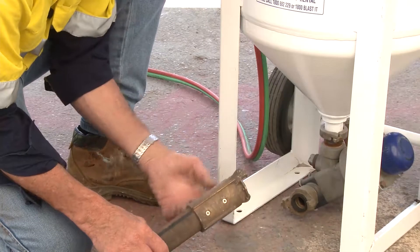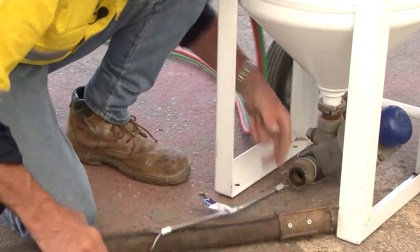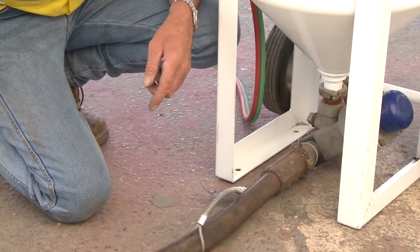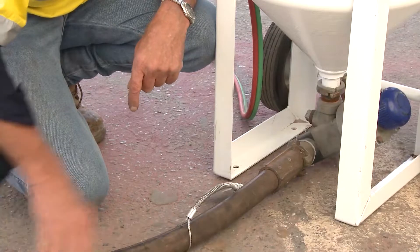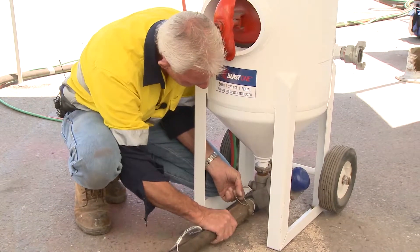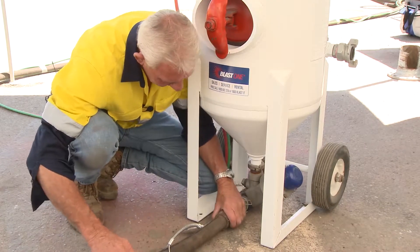With this gasket and this gasket, by coupling these two together — first I'll put my whip check on, slide it underneath so it's out of the way, bring your hose around and twist that coupling on there. Now if you have this hose twisted up, you'll find that it'll want to twist back all the time. So position the hose to take the torque off so it twists back onto that coupling easily. Now if I put the two pins in, that holds that coupling nice and still.